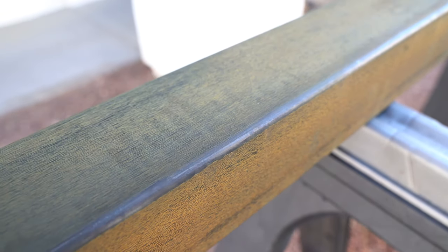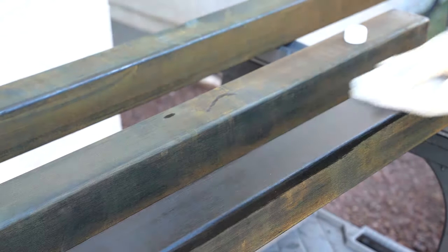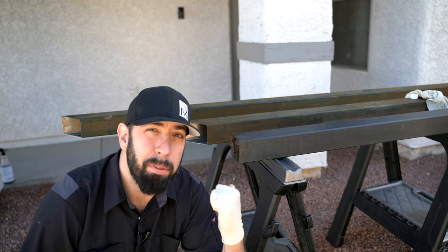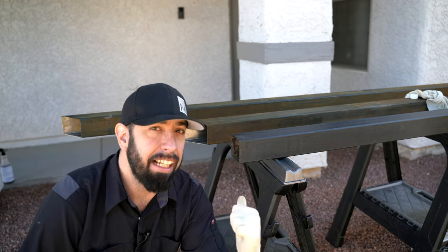There are also some runs and fingerprints from where I touched it while the product was still wet. The instructions say you may need to add multiple coats. So I'm going to add another coat, but this time do several things differently. I'll do each piece individually so I can focus on getting a good quality coat and won't have to touch them while moving pieces around. When they're done I'm going to rinse them and dry them with a towel immediately. While degreasing, I noticed I was wiping the surface rust away and the wetness of the degreaser really brought out the blacks, which is exactly what the clear coat is going to do. Just that little bit has brought back my confidence that this is going to look exactly the way I want it when it's done.